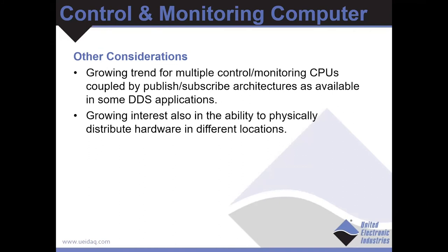So other things you may want to consider: there's a growing trend to have multiple CPUs, and even sometimes different parts of the SIL or HIL located in different locations that are all connected together. A lot of times these are connected by some sort of DDS, which is a software application that allows each node to publish the data it has and subscribe to data from other nodes. And we're starting to see a lot of interest in those, in SILs and HILs.